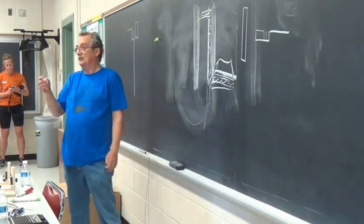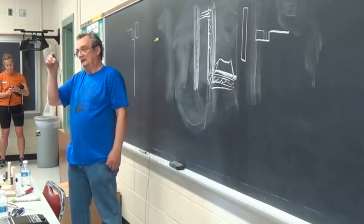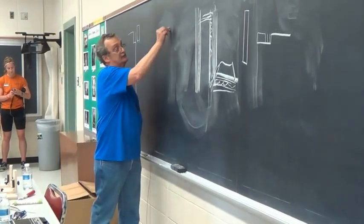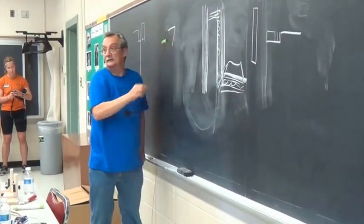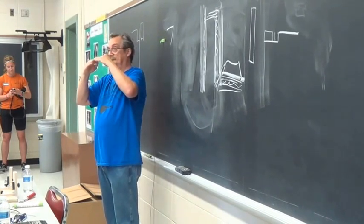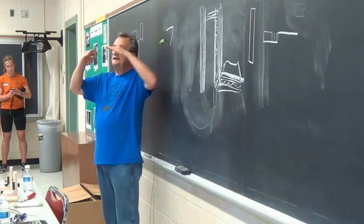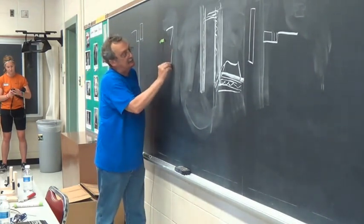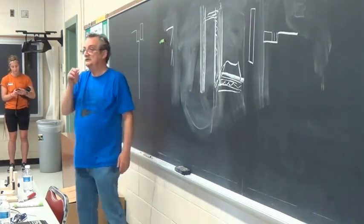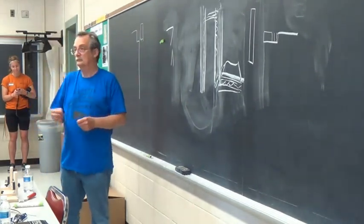I use a little emery board, a piece of wood with like 120 grit, 220, and like 350. When I get real close, I go to the 350. And if this is your surface pearl, I'll actually undercut it a little bit so that I can butt that top nice and tight, so I have a tight joint. That's just a quick swipe over a 320 grit or something? Yeah, just a little bit. I don't want to make it like a 45 degree. The angle is going to be so slight, but that point of contact at your visual is going to be tight. Also, that's another trick you can use in creating that zero joint.